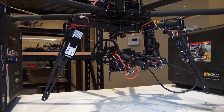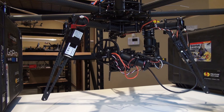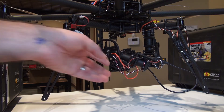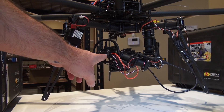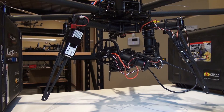One more thing: since we have 5 volts running through all of this and the HDMI converter runs off 5 volts, we can actually pull 5 volts right out of our tilt Radian to keep the wires nice and short. So I'm taking my 5 volts out of port 3 of the tilt Radian, and that's actually powering my HDMI to SD converter.